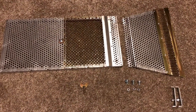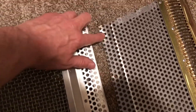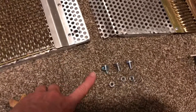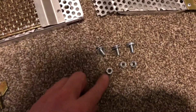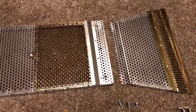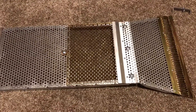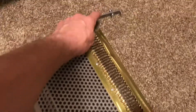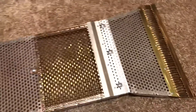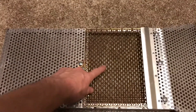Part two is going to start off by putting the classifying screen together. There are three holes — two and three. These three screws and nylock nuts go together here; these are Phillips head screws and it takes a 7/16th wrench. I'll bolt that together and show you what it looks like. I got this all put together; the only thing left is to get this wing screw in here and mount these braces to hold down the front. I'll put the rest of the sluice together with the new parts so I know exactly where to mount this screw in this screen.